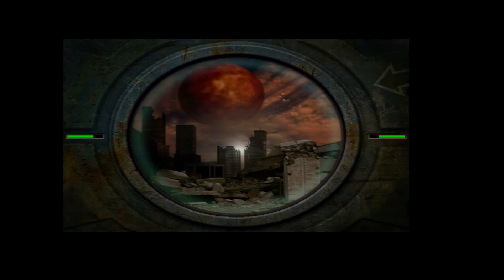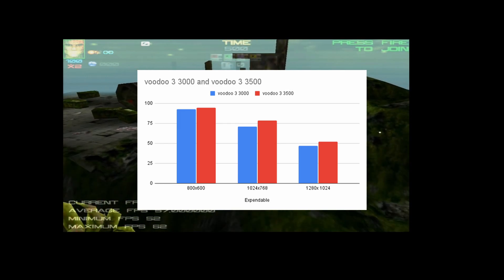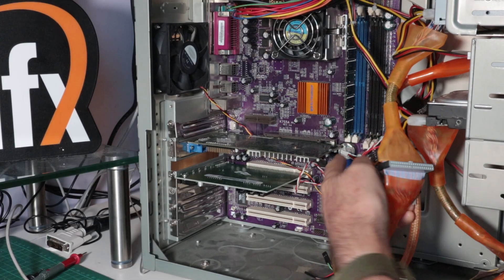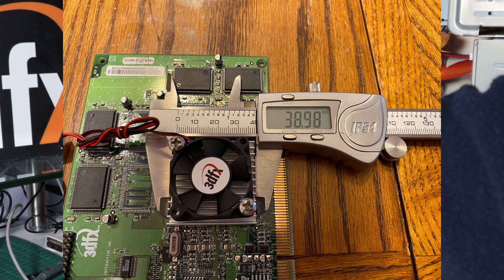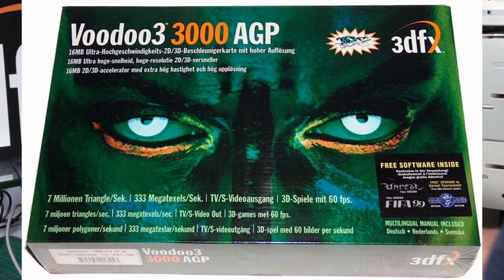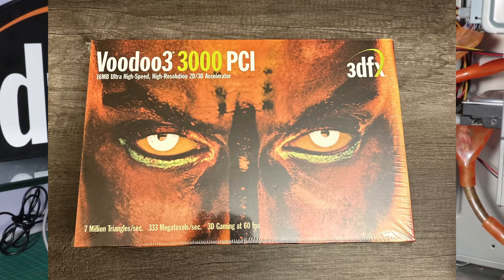Expendable and we're back to a similar pattern where they're pretty close at 800x600, just a few frames in it, but the gap slowly widens at higher resolutions — up to maybe eight or nine frames per second more from the 3500 at 1280x1024. Of course, back in the day people did try to overclock these cards. There were all sorts of fans strapped to the fairly inadequate heatsink on the 3000. People still continue to do this to this day, now more in the interest of preservation to keep their Voodoos running cool so they last longer. The AGP version of the 3000 box didn't really give the game away, but the PCI version had that fiery heat-inducing looking color on the box.